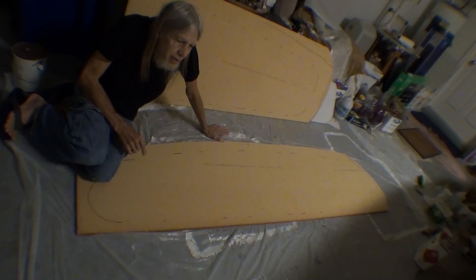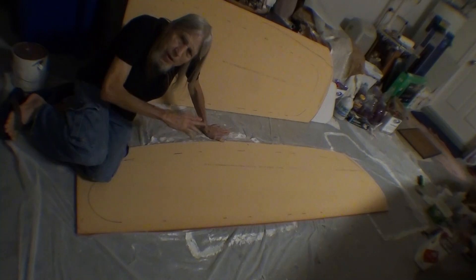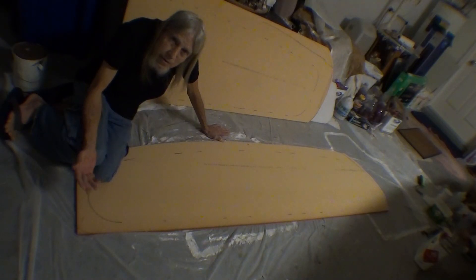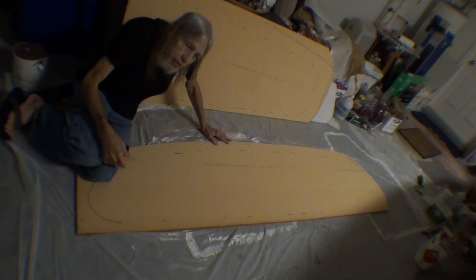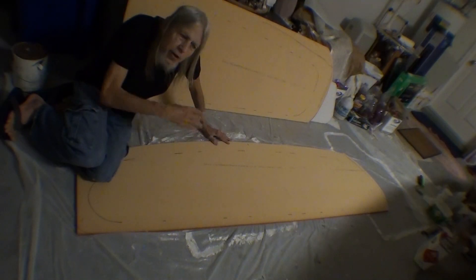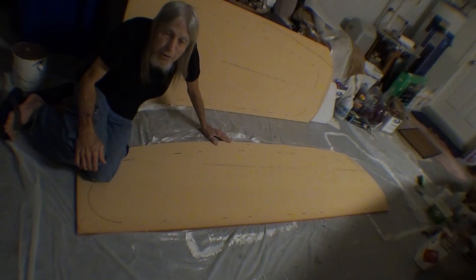My first thought was to put in a window with a slot in it that could be open, and that would give me a much smaller opening. I decided on something different — to have something over the entire opening of the window that would open, so the hole cut in the hull would be fully open for airflow, as though the windows had been completely taken out of the boat.